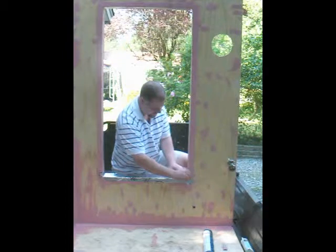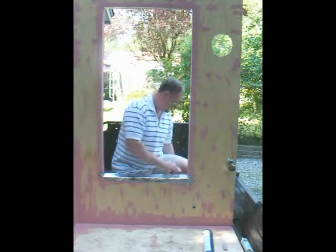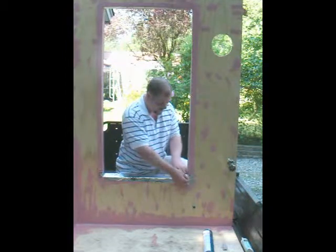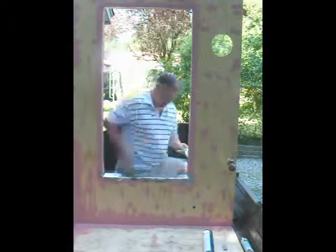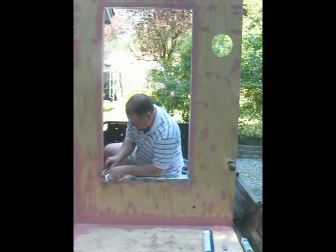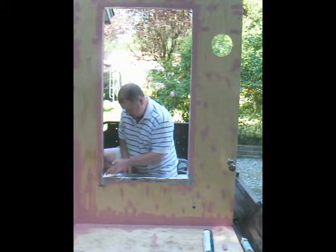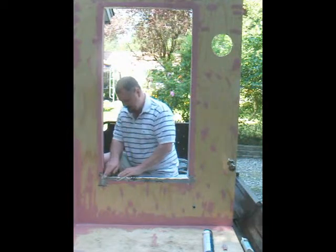Make sure we don't have any bridging — that's nice and tight. If you end up with too much bridging, then when you put the window in, if you don't have enough tolerances on each side, you're going to rip this with the installation of the window, which is obviously something we would not want. You want to center your inch at the beginning, in the middle, so that it's right over top of your seam. Then you're just molding it down, over top, and up. That guarantees you a nice watertight corner.